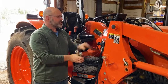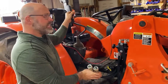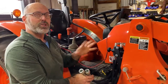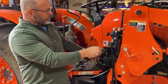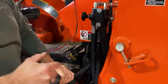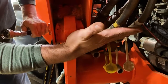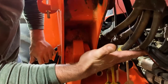Now it's time to connect the supply lines to the switching valve from the loader system. Before you disconnect anything, relieve all the pressure in your loader system by moving your loader valve to all four positions several times — that'll make sure all the quick couplers release cleanly. I'm going to first work on the front circuit of this remote hydraulic valve. Today we're going to be using the white and the yellow connectors — those are the lift circuit for this tractor. The red and the blue are the dump circuit, but today we're hooking to the lift circuit.